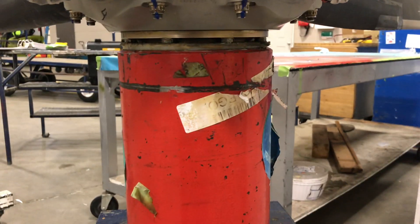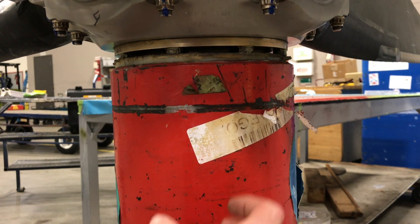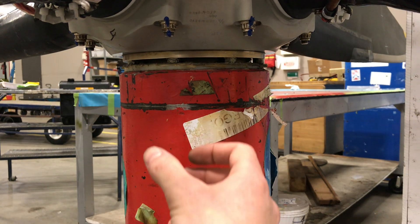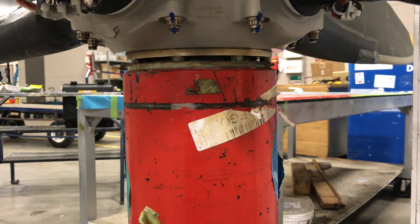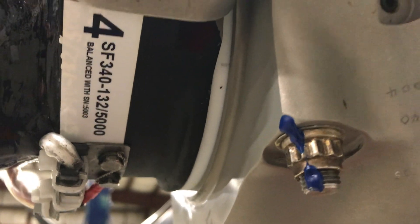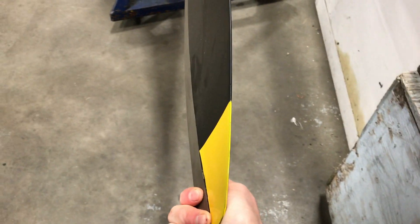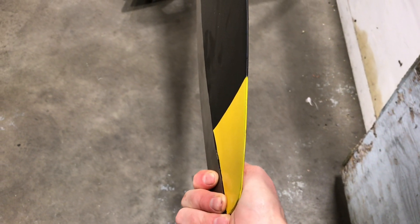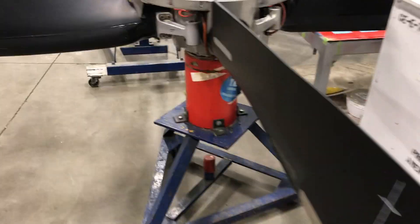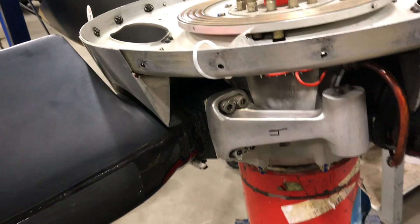The dome is sitting inside this little holder here. The dome just extends to right about here, and there is a cap on the end. When we go to install the propeller, we put the beta tube through and feed it through that way — there's an O-ring on the cap to seal it. That white ring in there is a Teflon shim. They come in different thicknesses depending on the wear of the hub, and no two blades may be the same. That's how you shim out a blade for its up and down movement — so you don't have these blades flopping around inside.